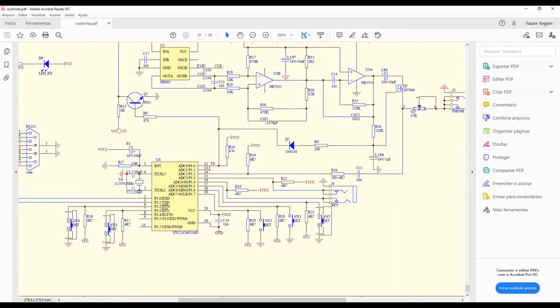You keep this part intact because it's the microcontroller responsible for the Morse code, as I already told you, the speed and so on. Instead of using the circuit board switches, I will remove those switches. It's not necessary, but I will remove them, in order to use the printed circuit board pads to connect to an external push button. As you already saw in my video, I'm using external push buttons instead of those in-circuit push buttons, let's call them that. I will also remove this jack and extend those connections to an external jack to connect my manipulator, my keyer.